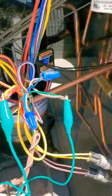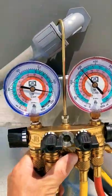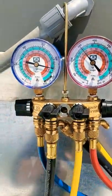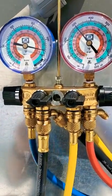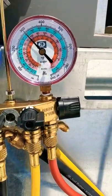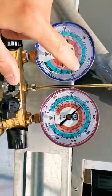This is a 410A unit — refrigerant. Just looking at the gauges. Right now it's just settled — it's actually on a time delay, because units like this don't actually like to short cycle — like turning them on and off repeatedly. Perfect pressures for 410A would be 100 over 300. That's perfect. I mean, that's just when filters are clean, fans are running good, no blockage at all, duct work is fine, your return is big enough. Right now with about 80 degrees outside, we'll probably be around maybe 110 to 115, over maybe 350.